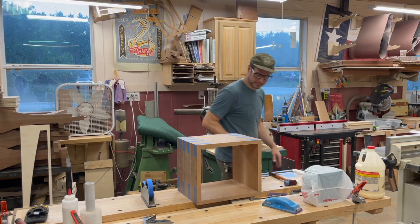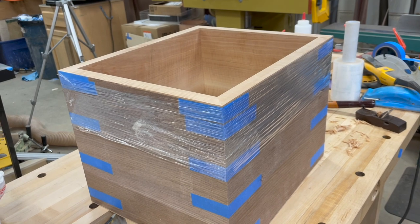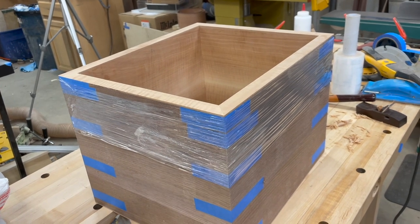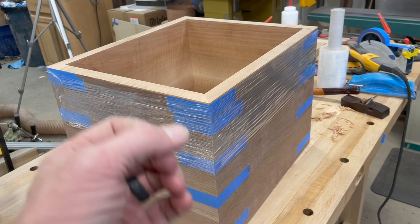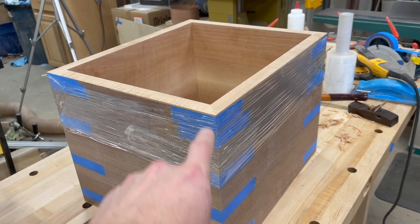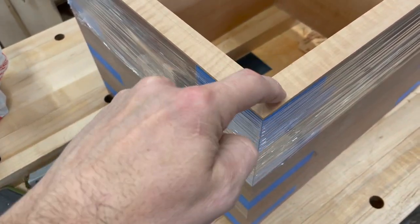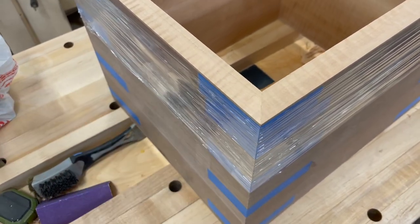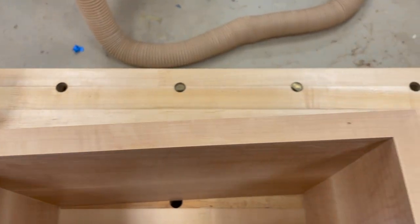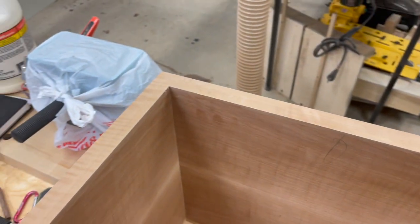Thanks for watching. Here it is — I put some shrink wrap around it because it pulls it together really nicely. On this particular case I would probably just do a glue joint here since it's not coming in and out, so there's no risk of drop shock breaking the miter. You get a 50/50 glue-up of long grain to end grain here. If this were a removable case piece I would do some L-brackets — L-tenons I guess you'd call them. The outside looks good, and the corners are all nice and tight. The insides look nice and tight too. See ya.